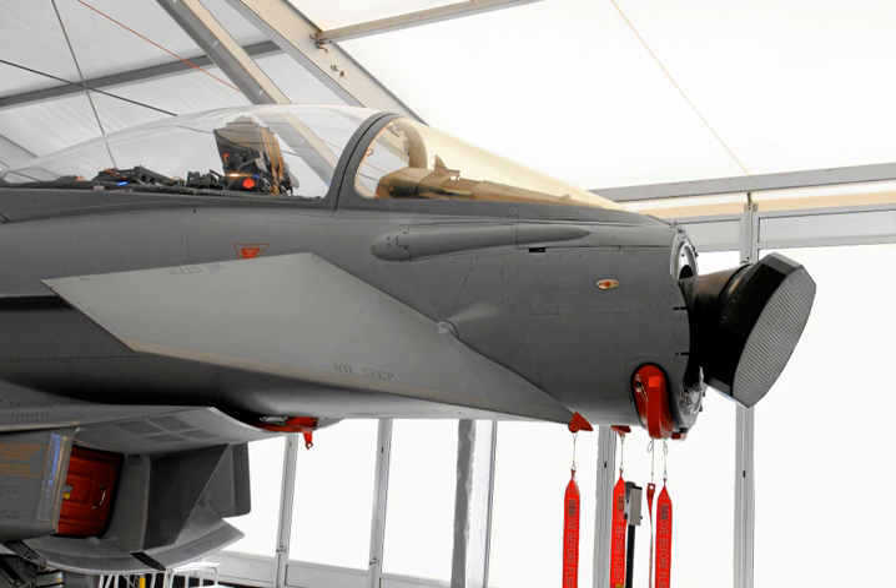This gave rise to amplifier transmitters with a low-power solid-state waveform generator feeding an amplifier, allowing any radar so equipped to transmit on a much wider range of frequencies — to the point of changing operating frequency with every pulse sent out. Shrinking the entire assembly into a single transmitter-receiver module (TRM), about the size of a carton of milk, and arraying these elements produces an AESA. The primary advantage of an AESA over a PESA is the capability of the different modules to operate on different frequencies.